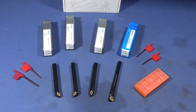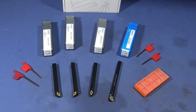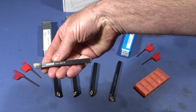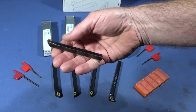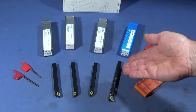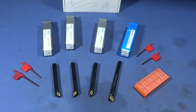Today I'd like to show you a new four-piece CNC turning tool set that I've got from Banggood, to use on my Myford ML7 and my Chinese mini lathe. It's a 10 millimeter shank set and it takes all the same inserts — the DCMT 070204. This is a great set if you're new to engineering or you need some new tools. Several years ago I bought an 8 millimeter one on eBay with the same insert and it cost me 20 pounds for a single tool. Today you can actually buy this full set for the same price, so I'll just show you some screenshots of the Banggood page.